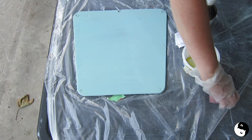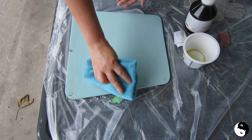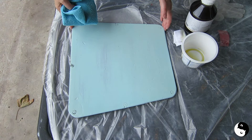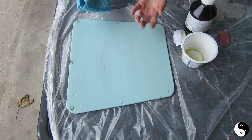This is 320 grit. What I have here is just a microfiber cloth to wipe away the excess. It needs a really smooth, buttery finish. Hemp oil takes a full one month to cure, but as it's drying and curing over that time you can come back with your cloth — if you notice any wet spots, that's the oil releasing, and you can just perhaps once a week come back and wipe it down.